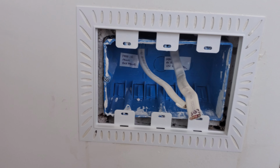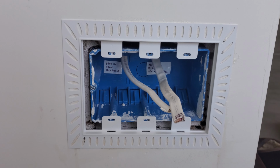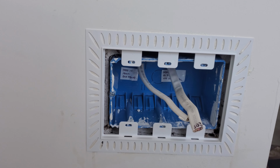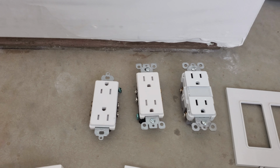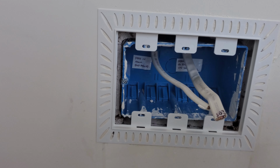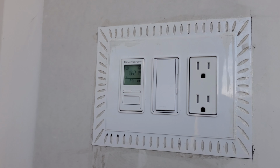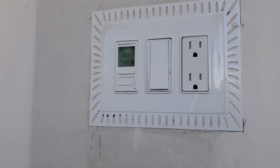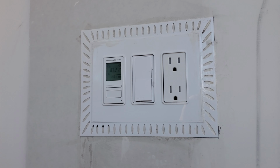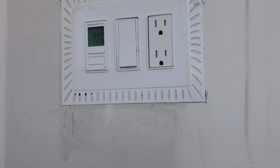And then, as you can see, there's still room to work on your wires. So it's bigger than the box itself, so you can do that before you do all the wiring. So basically we'll get all these 3 outlets wired up in there, and then we will pop on this ring, which is the mud ring, and that's the one that's already installed on this outlet plate. So you can see, pretty soon the one here that we're about to work on will look like this one.